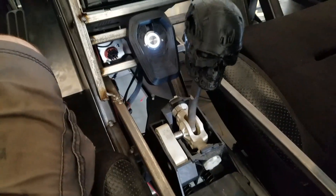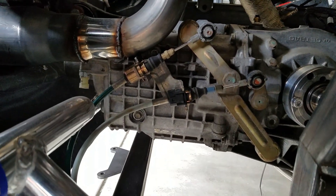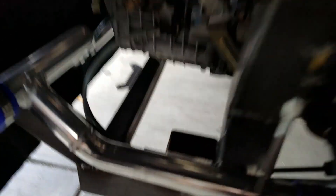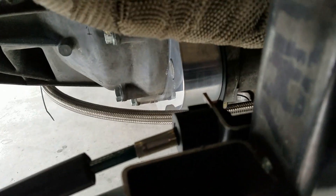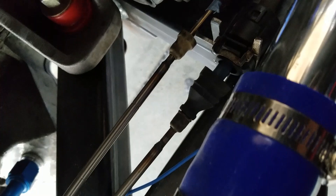Here you can see that the setup for the shifting is the same. I've just bent those around at a modest radius. I've made a mount here for that set, and then there's another mount over here for this set. And then I've connected them with stainless steel rods - we just drilled a 5mm hole in each end and then connected them by TIG welding.